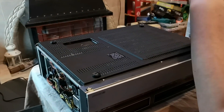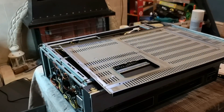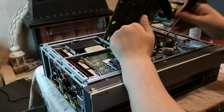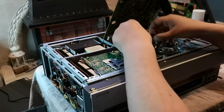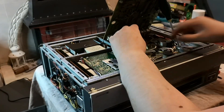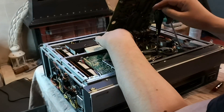Standard vacuum of all the dust out of the machine, then removal of the bottom panel, flip up the bottom board, and replace the motor and capstan drive belts. I also removed the load cradle and replaced the belt — you just remove the little circlip, get the belt out, and replace it. I didn't cover that in this video partly because I was running out of battery, but I covered the process in the Nordmend V500 video. As I said there, these machines are identical except for branding and price — and also the front panels are different.